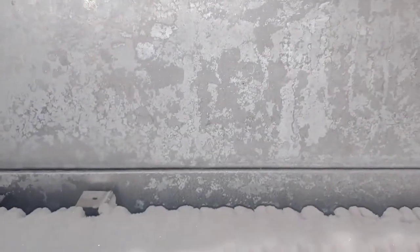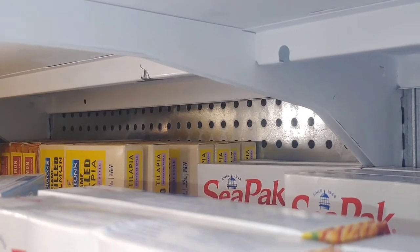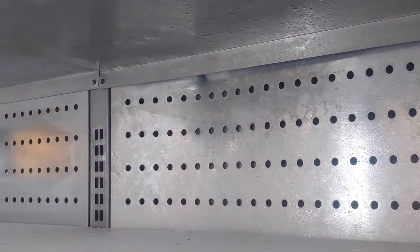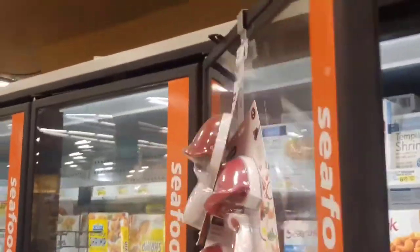The ice is blocking the whole airflow, but it's mainly in the back — there's a little bit here that air can get through, but not much. They're also overfilling the shelves. Look back there — the middle of that rear wall panel is pushed back, it's really bad up here. They packed it so hard they pushed the wall in, and that's going to block airflow too. Once I get it defrosted and turn these fans on, I bet these two right sides still don't have much airflow.